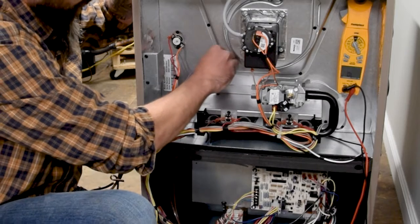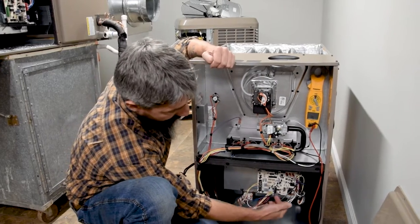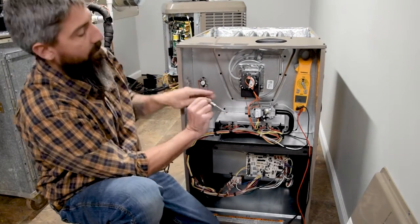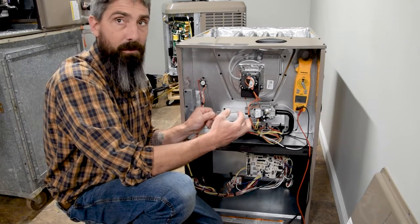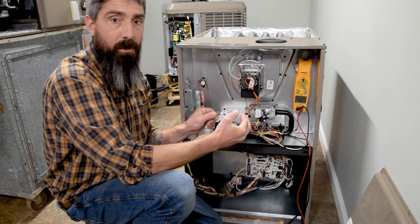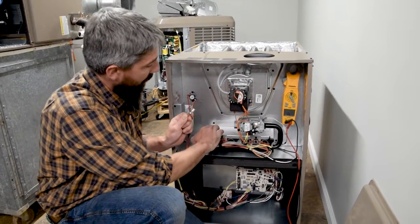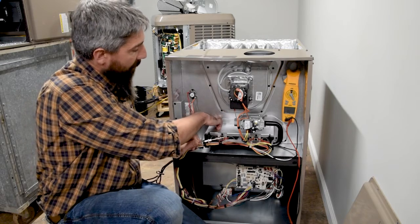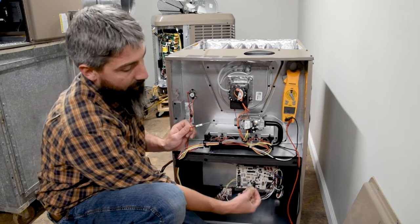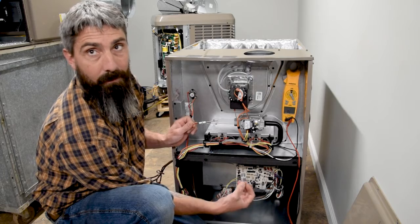So what is flame rectification going on here? When this furnace operates, the control board is putting out the AC voltage. It's coming up to the flame sensor right up here. As this sensor sits inside the flame, it's rectifying the voltage. What happens at that point is it will produce a DC voltage that's measured in microamps. The flame is literally making that contact to the grounding box — to your burner box — as that flame is running. And those microamps are picked up by the furnace control board, letting it know that the flame is running and it's okay to continue operating. That's how this operates.